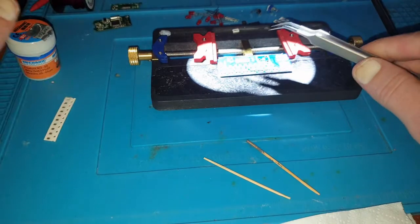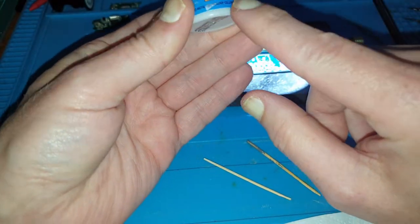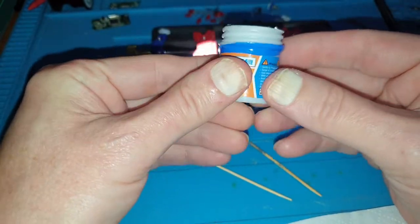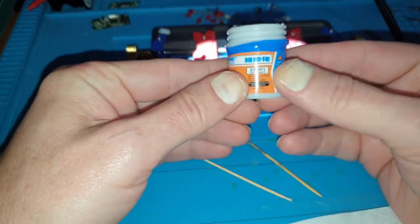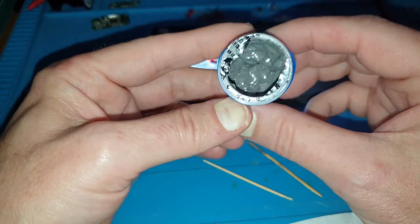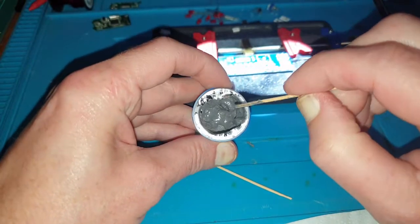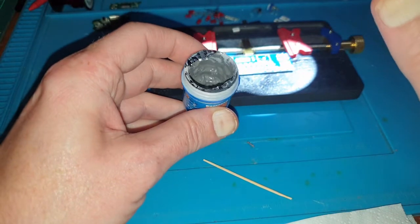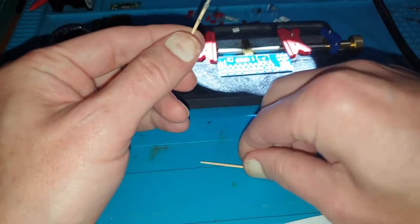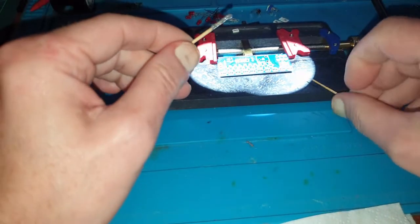So I'm going to do two resistors and an IC. You can get this stuff in syringes as well. Because I'm not doing this commercially — I just learn as I go. I got a few of these about three years ago. The date on this was May 2016 and we're now in 2020, so it's past its one-year shelf life, but it is still usable — it's just not as liquidy. The best applicator is just toothpicks. Get some on one end and use another pick to put it on the board. I'll switch to the microscope camera now so you can see it better.